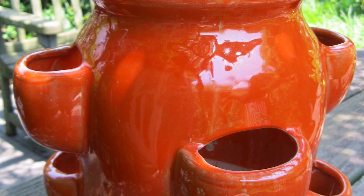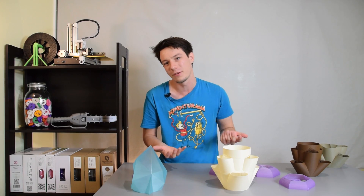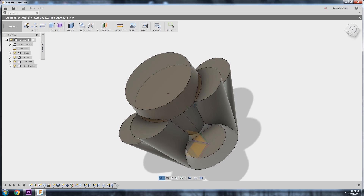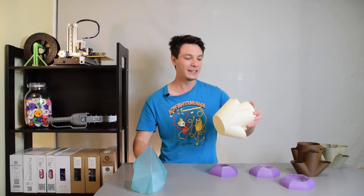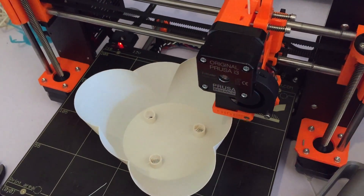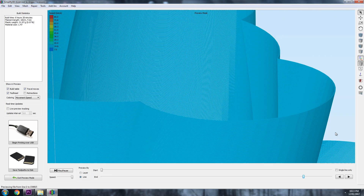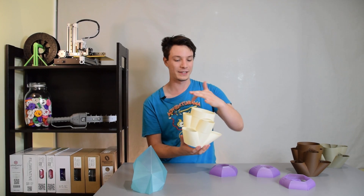A strawberry pot has openings in the side where the runners of strawberry plants can spill out, since strawberries like to spread. There are specially designed pots for this. This file took quite a while in Fusion to work out the overhangs. Essentially it's the same concept as the cone — it builds up to a massive flat area that is ignored in Vase Mode, especially in Simplify 3D if you turn off all top layers, leaving an open top. It builds up and then jumps across, doing a massive bridge over the openings. I needed to make sure each bridge was a straight line — you can't bridge a curve because the plastic follows the path over thin air. So I inserted little bevels or chamfers to make each bridge flat, and then it eventually comes back to the curve and builds up again.